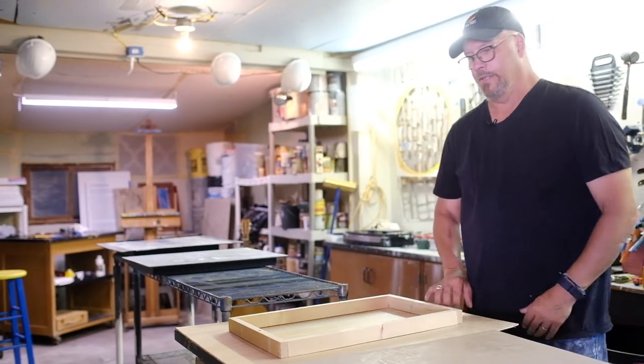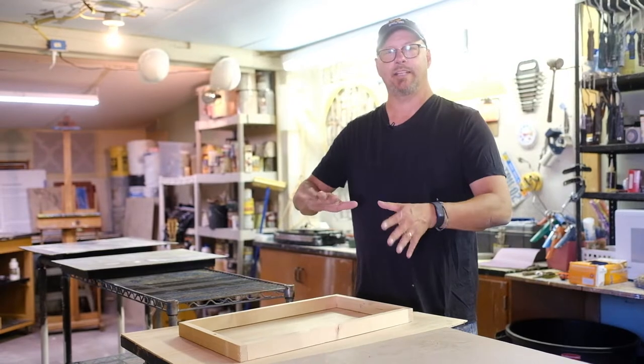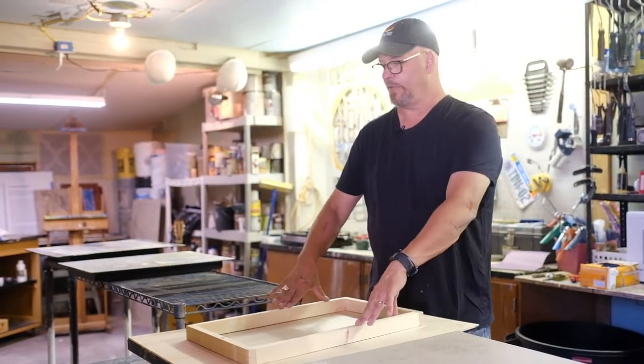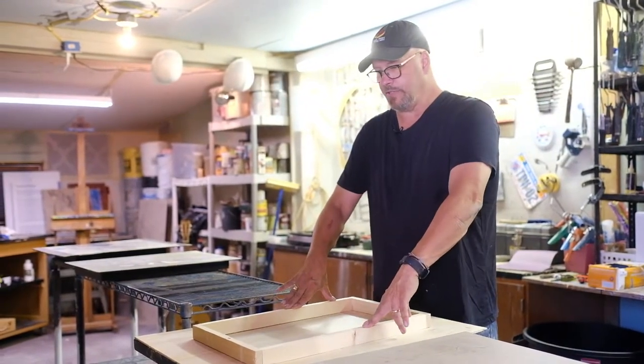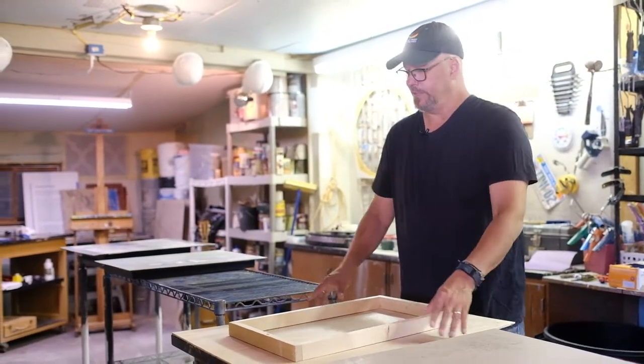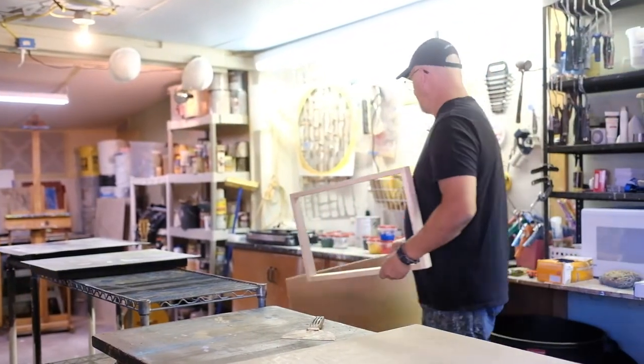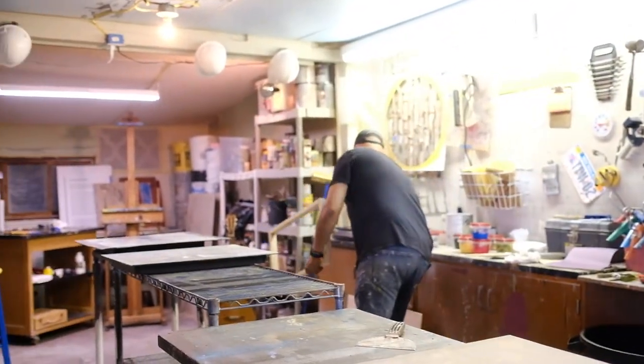It's painted. The hardwood's a little heavier, but it doesn't flex and bow as much according to weather. So this one, you can see it's a little bit wobbly, but prime on both sides, sand the edges, and it's a good solid surface to put Venetian plaster on.